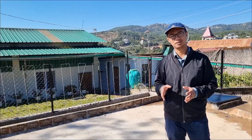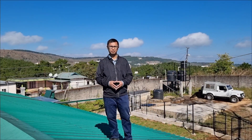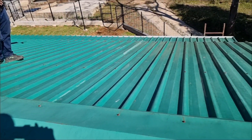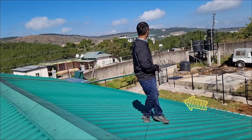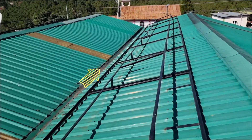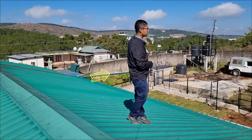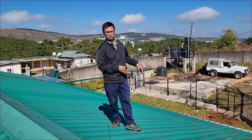Now let's go to the roof, for which the surface area acts as your watershed area. I'm at the roof now and you can see the greenish portion is the sloping roof going down. The whitish portion is the gutter — the inside of the tin — and this gutter slopes down and meets up with the main gutter line. Similarly, we have another gutter in the center and one beyond there. All three gutter lines meet up in the main line and go down to the preliminary filtration tank and then to the storage.